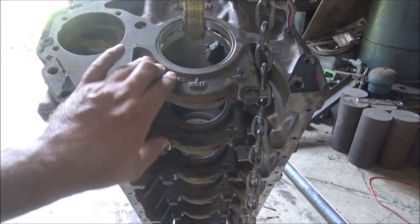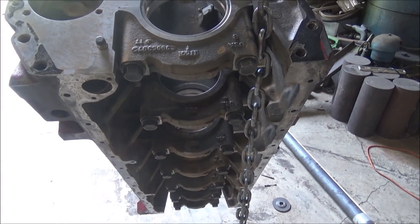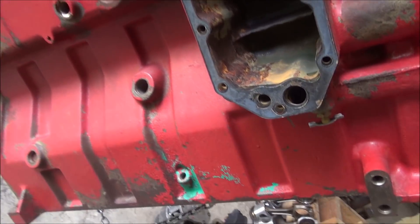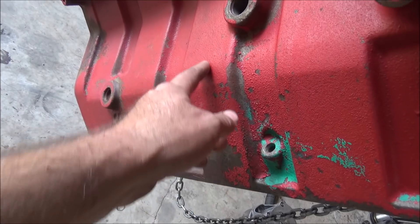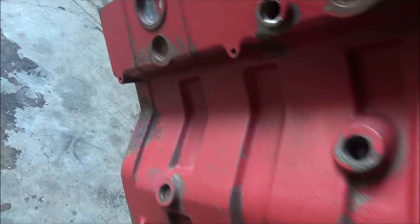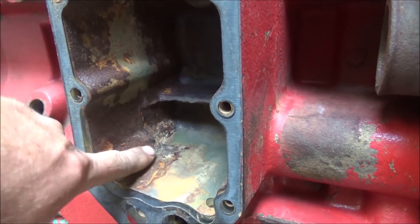Also, the paint helps to get the oil to drain back into the pan, which is a good thing. It helps carry the heat away better. And it seals anything up to keep it from leaking through to the outside. As is often the case with castings, sometimes they're a little bit porous and the oil comes through. I'd say that's probably the case right in here where most of this paint lifted off and you can see it's all bubbled up underneath. Here they painted over stuff, or it has wetted through into the paint. Still got some buildup there to scrape out before I paint it.